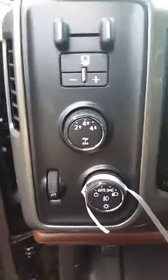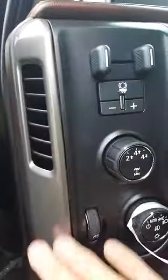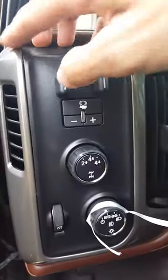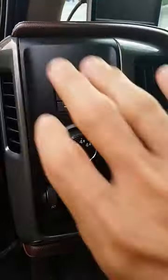The easiest thing for this, just in case anyone wants to do it: you pull your fuse panel off. You want to get that off — this whole assembly here, down to here — I believe this comes off with it as well. This is all just held in with clips. Harbor Freight sells these small plastic pry tools. I just went in here and worked around all this, and then this whole assembly pops out.